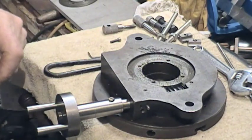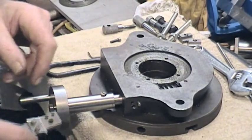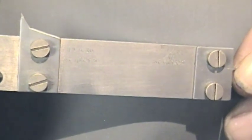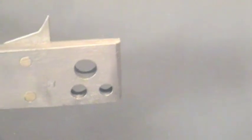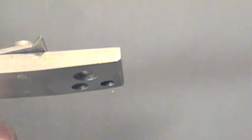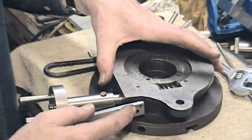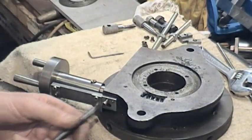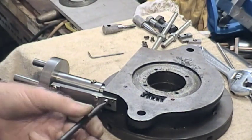The other thing is here is how to set the table in a particular position. This is a piece of bar — this end is a little pointer and there's another pointer. Three holes: one is for a locating pin, one for a screw, and the other one is for a locking device. It's been filed off to a slight angle, mainly so we could get parallel to the shaft. Put that on the locating pin and the screw in there.